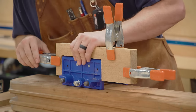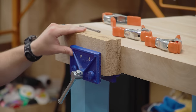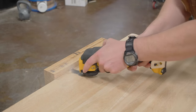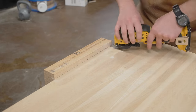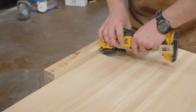There are two holes that need to be drilled in the front of the rear jaw — those are access holes so you can screw the cast iron part to the workbench. With the rear jaw screwed into place I can put the filler piece on the back side and mark and cut the ends to the appropriate length. A little glue and some squeeze clamps will let it set up. Of course the front jaw is the easiest — just put it in place, secure it with a couple screws, and then think about how to flush trim the top of the jaws flush with the top of the workbench. My first thought was to use the router setup the way I did with the tenons, but I decided not to because turning that amount of material into dust seems unnecessary — let's just cut it off instead.